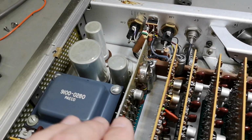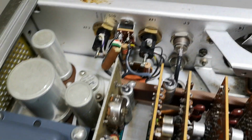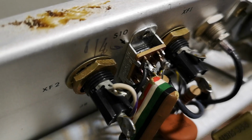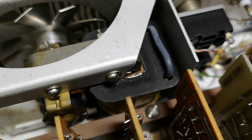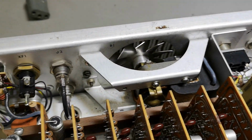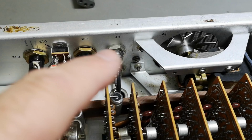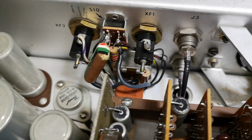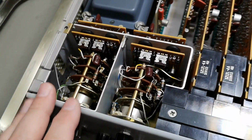So what have we got over here? That will be the power supply. See, we got all sorts of rectifier diodes and stuff. But what is that? I'm not really happy about that. So this is a modification. And if you look at the color and thickness of this wire, and if you look over here at the fan, so I believe this is the wire. And what are they doing? They're putting a capacitor in series with the fan, so it's going to run slower. Hee hee. But it's still a little bit crusty. Got some capacitors, the voltage regulator. So this will be the input.